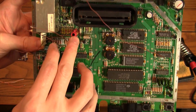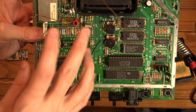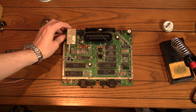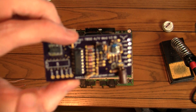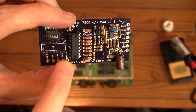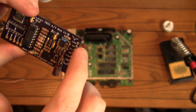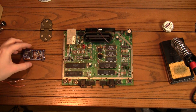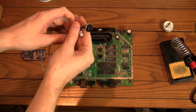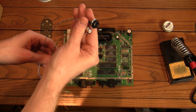Next I took three resistors out, and I've got five wires going to various places. They will all go back to my five input connections here, and I've got my luma, my chroma, and my audio out on the other side. Those of course will go to my S-Video and my audio.